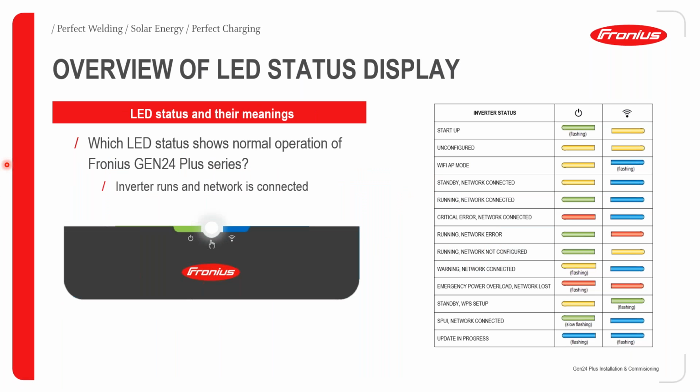In terms of the LEDs in the front of the Gen24 Plus, they can indicate many different things. For example, I have a table on the right, and if my power LED over there is flashing and my communication LED is yellow, it means that the inverter is starting up. Okay, so it's nothing you should stress about.